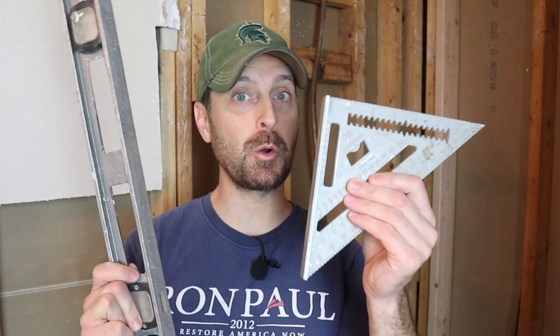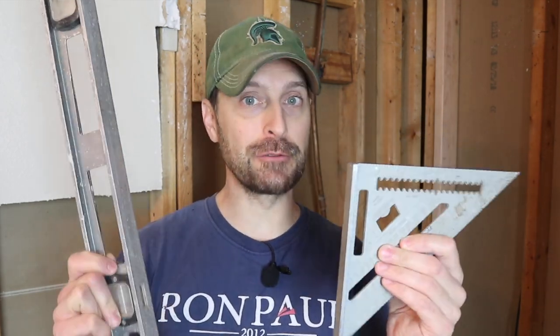The next video is a big one — we're going to be setting the shower pan and we'll talk about two methods: either with mortar or a non-expandable foam. We'll also show you how to install the DenShield and waterproof everything, and then we'll be tiling our walls. For this step in the process, remember the two biggest things: dead flat walls, plumb walls, and square corners. Get those done and you'll be very successful.